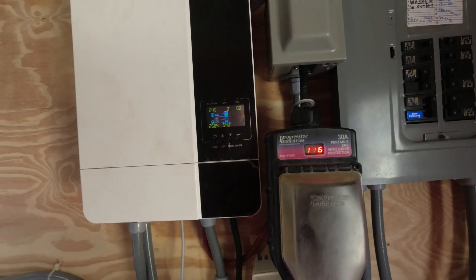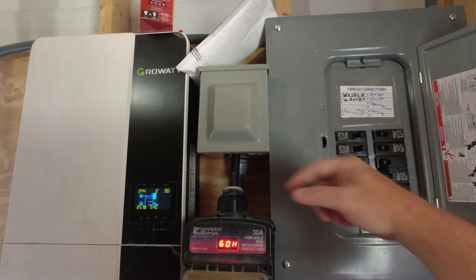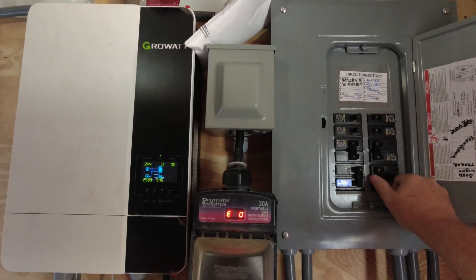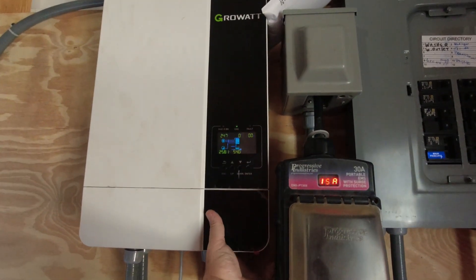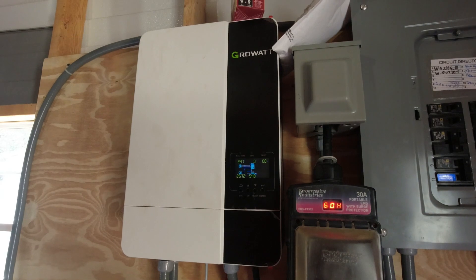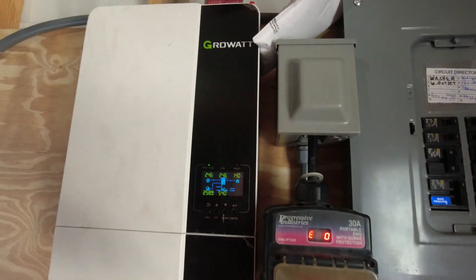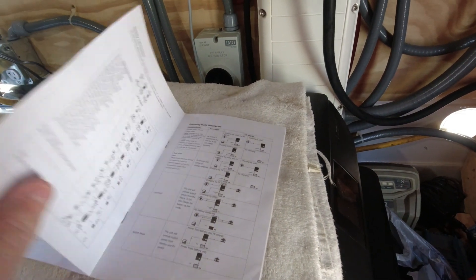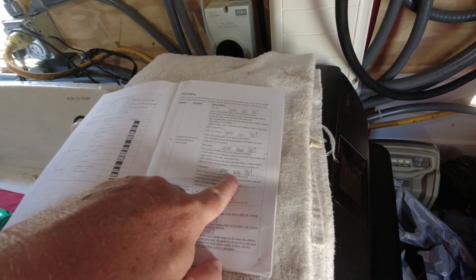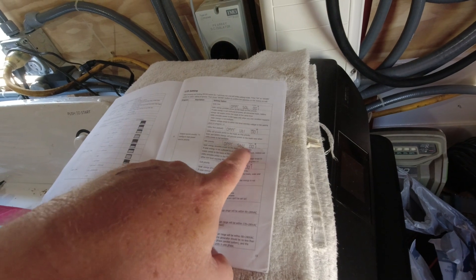So that takes care of the dryer for now — eventually I will add the second unit. Let's turn the dryer back off. It's running smooth; the fans went off too because it's not going through the inverter pulling all that heat. Let's turn the dryer off and put the inverter back on. You'll see it reconfigure — solar is coming up through and it's charging the batteries. I've put it in solar first, utility second, batteries last. Last night I had it in solar, batteries, utility last.